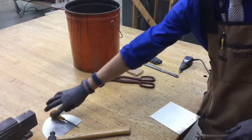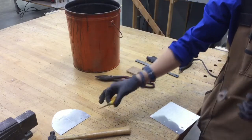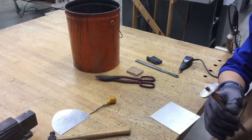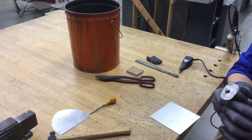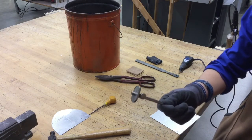Works on the same principles as a scratch awl, scratches lines on metal, except this one is kind of like a free-handed pencil. It's like a pencil with a little platform or guidance system attached, and it has a little point on the end. This little platform moves back and forth when you loosen the knob. This should be set to 1/4 inch. If it's not set correctly, or if you're just not sure, let me know. I'll be more than happy to set it up for you.